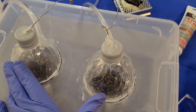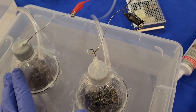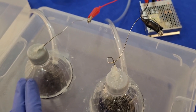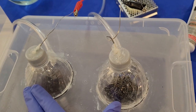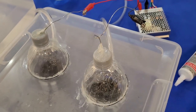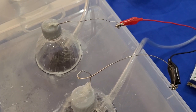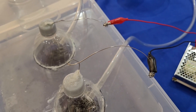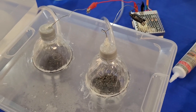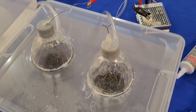This is one set, and let's say I'm getting a quarter of a liter of oxygen per minute, which is overreaching, but let's just say that I'm getting that much from one of these units. What I could do is cascade these and have, let's say, 5 units. Then I'm getting 5 times that. So then we're getting into numbers that you can supply with good confidence that you're doing some help there. 2 liters per minute or more is what you need for medical grade oxygen.